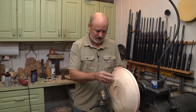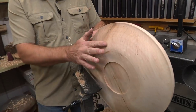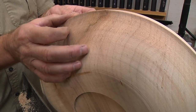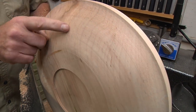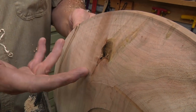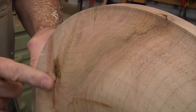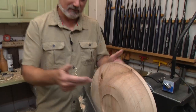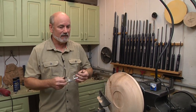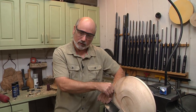We're sneaking in on our OG shape — you can see it going around and curving. The rim is still pretty thick so I've got about a quarter inch more to take off. I also ran into a hole in the wood, which is cool — if it stays, that's going to give this a lot of character. When you're working with stuff this big, it is dangerous: watch your speeds, your technique, and where you put your hands.